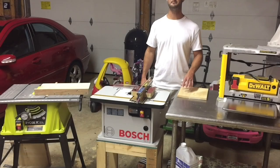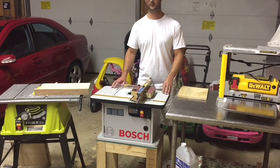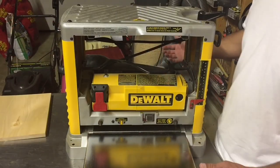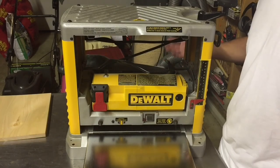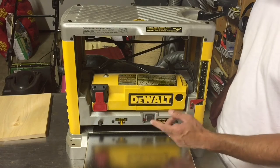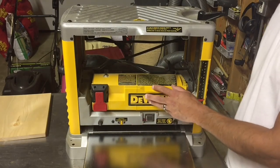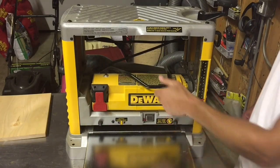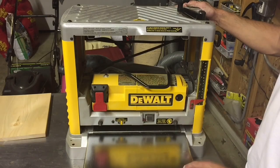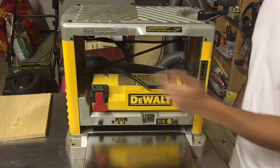There were three major tools I needed for this job: a thickness planer, a router table with a finger joint jig, and a table saw. I buy my boards in 6-foot lengths because they're manageable. I pass them through the planer and take off about 1⁄16 of an inch each time. Because the boards are so wide, the planer can only handle so much, so I clamp it down, run it, pick it up, move it a half turn, clamp it back down, and do it again — about a half turn each pass.